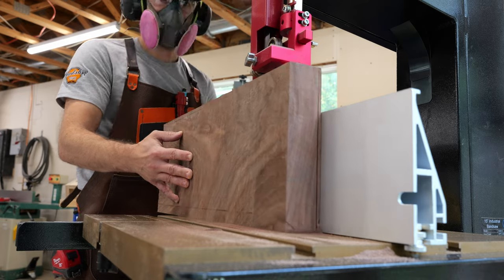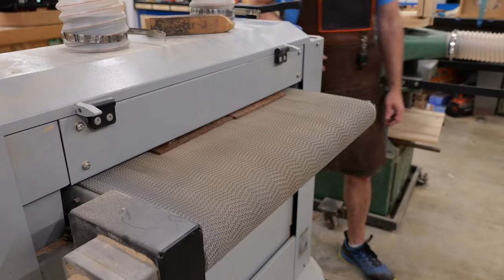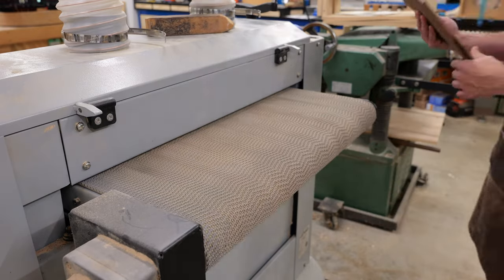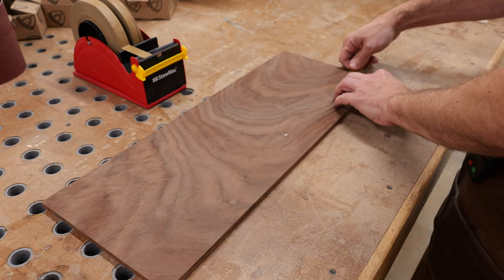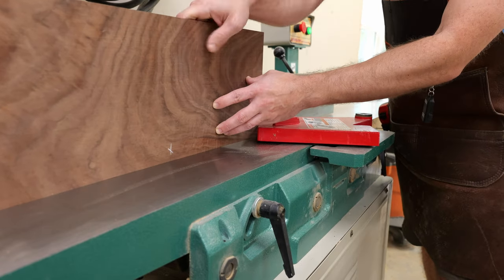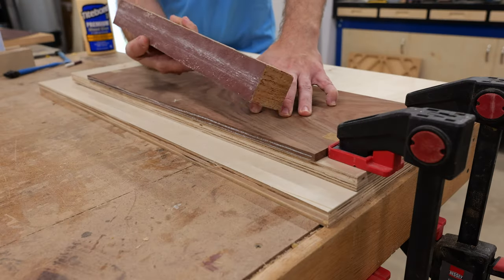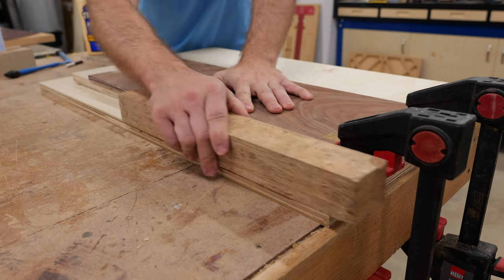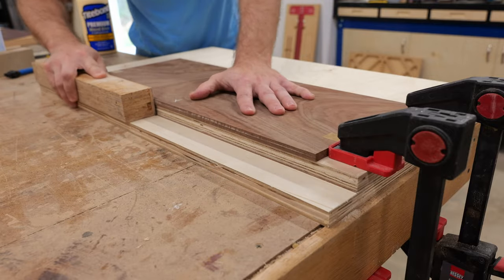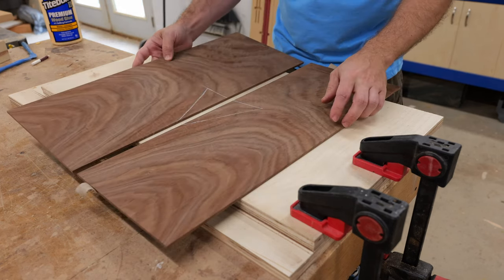With the rim wrapped up, I turn my attention to the back, starting at the bandsaw to cut slices from a gorgeous board of claro walnut. A drum sander really speeds up the process and helps control the grain pattern. After jointing and refining the glue seam on a shooting board with a long sanding block, I check the result — this bookmatch is ready to go into the clamps.